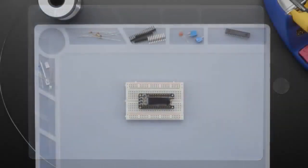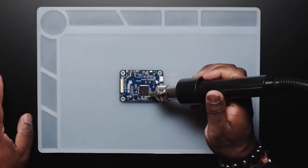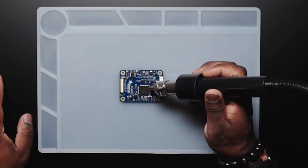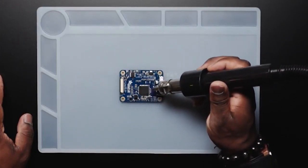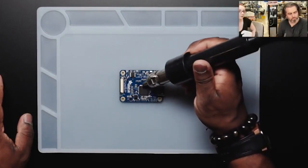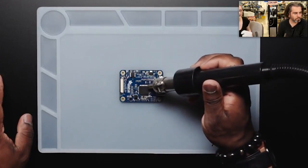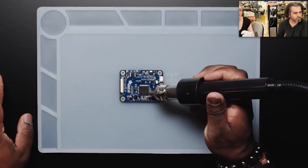Next up, we have this silicone mat, and this is a really cool mat. I actually picked these up for us to use here at Adafruit. You can see there are little notches. And because it's silicone, it's basically just like those baking mats — we were actually using baking mats, but they weren't as thick as this. This is four millimeters thick. So as Vance is showing you, hot air your board right on top of it. It protects your work surface. It also isolates the heat, so it doesn't scar your work surface, and you get more heat on the device itself.